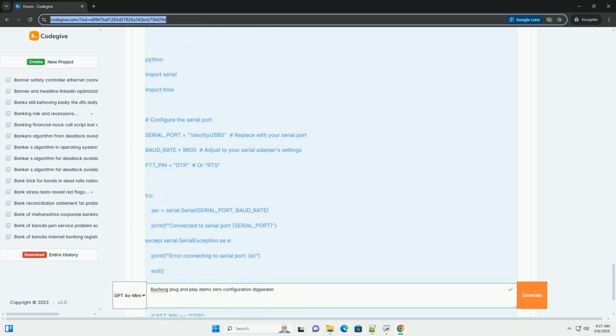3. Squelch: set the squelch to the lowest possible setting where you don't hear constant noise. You want the radio to open the squelch reliably for even weak APRS signals. 4. Power: start with the lowest power setting. Increase it only if necessary to achieve reliable coverage, bearing in mind the duty cycle limitations.